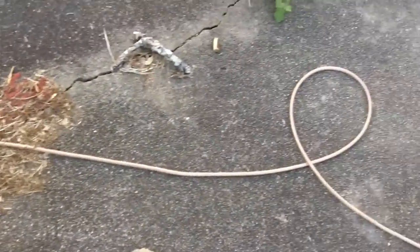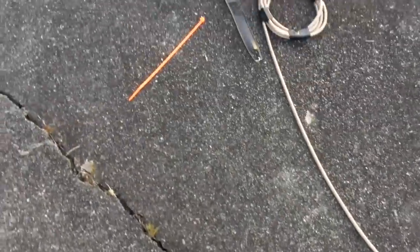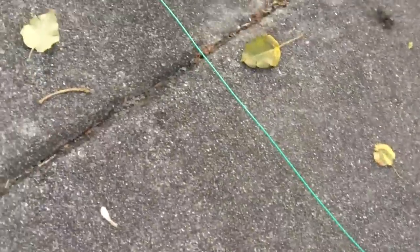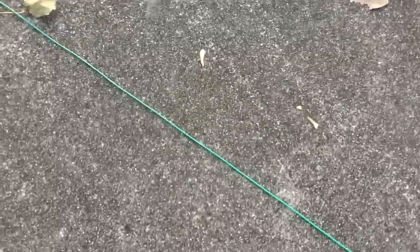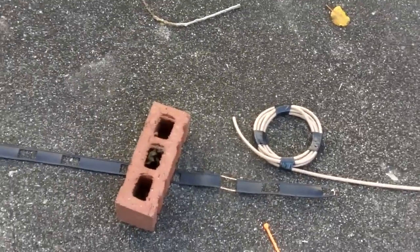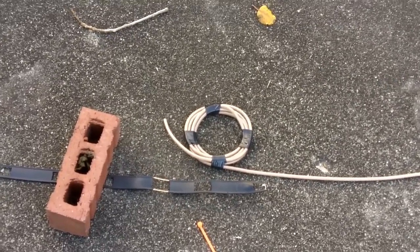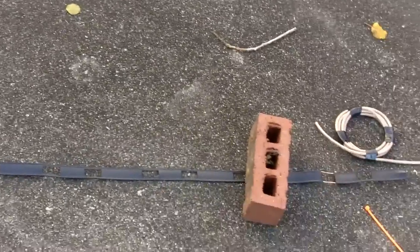Performance-wise, this antenna is about the same as an Antron 99. The Antron 99 is a half wave over a quarter wave, but the bottom quarter wave section doesn't really radiate any power — it's just for matching purposes. This antenna has been up for about 10 to 11 months with great results. The tree-mounted version uses a 1-to-1 voltage balun at the bottom instead of a coiled coax choke, because the initial RG58 coax was fine for 100 to 200 watts but started cooking at higher power, so a 1500 watt 1-to-1 balun was used instead.